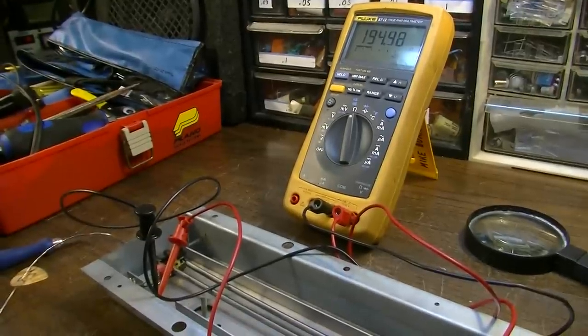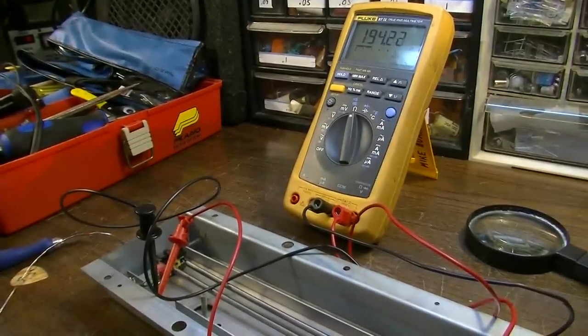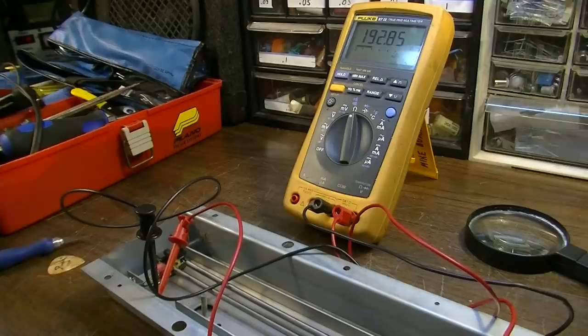And if you have a reverb tank also that doesn't appear to be working, you could do the same sort of thing. And I almost guarantee you, you'll find the break. You just have to be very, very careful, very delicate. Actually, it helps a lot to have this camera because this camera has such good zoom on it. I was actually watching my work through the camera's viewfinder, if you can believe it. But there are other alternatives too. There's actually one really good alternative if you don't have a way to see things very small that you're working on like that, that we will go over in a future video. But for now, I think, like I said, we have this thing fixed.